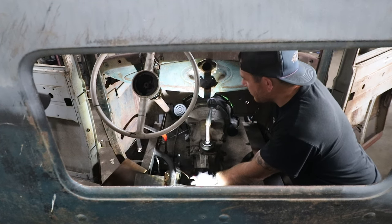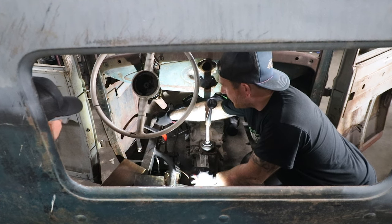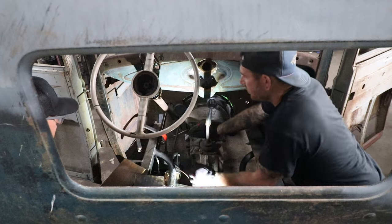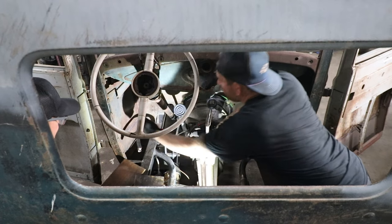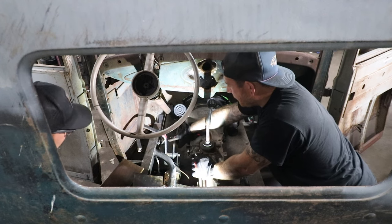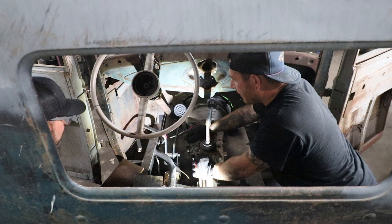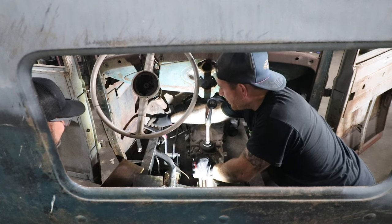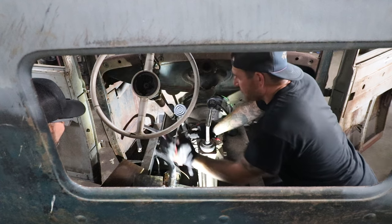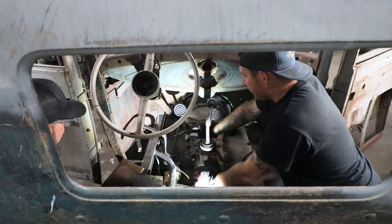And then once that cools, we'll heat it up here and bring it back so it's straight up. That should put your pedal right here. If I heat it, and we have it already bent enough that if I have to, I can heat a little further down and push it. But I think we have plenty. I think now we can just heat it up in here to bring it back, and then it'll just have a little Z to it and you'll still be pushing straight on.